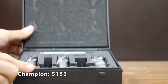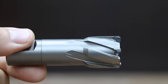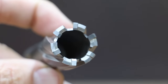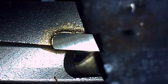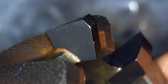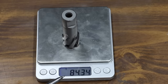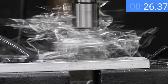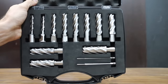At a price of $183 for three bits ($61 each) is the Champion brand. Sizes include 13/16, 15/16, and 1-1/16, and it comes with a pilot pin. Champion claims their carbide tip annular cutters last two times longer and can cut through stainless steel and ultra hard exotic alloys — we're going to test that. The cutting depth is one inch and the cutters weigh 84.34 grams. Just like the Eurobore, the Champion has carbide teeth and is a little bit faster than the Eurobore at 44 seconds.